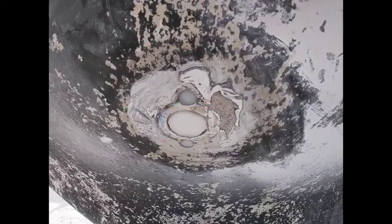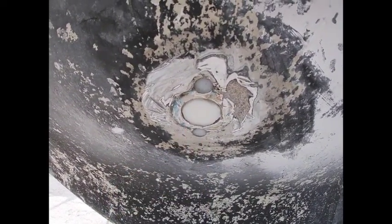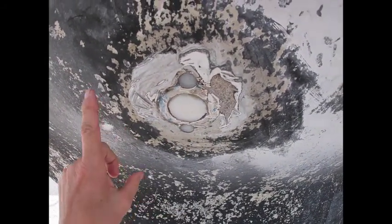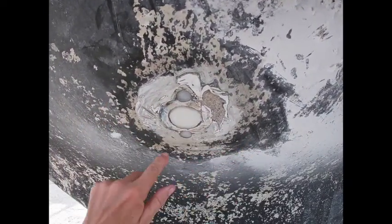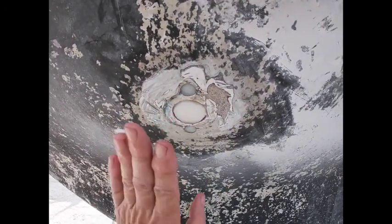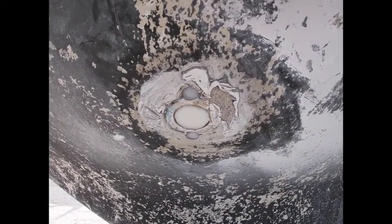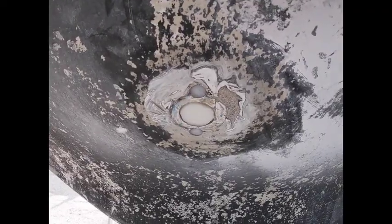This is thru-hull number 1 from the head, and it has been plugged with thickened epoxy. Now I'm going to take the grinder and bevel out a circle somewhere between 8 and 12 times the depth, which is 3/4 of an inch. And I'm going to grind that out, and then I'm going to lay some cloth in there to beef it up, outside and inside. And then it'll be sealed up real good.